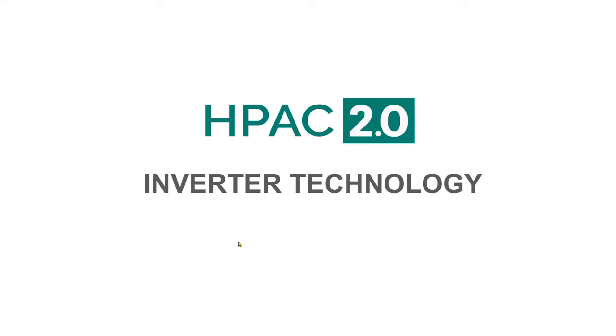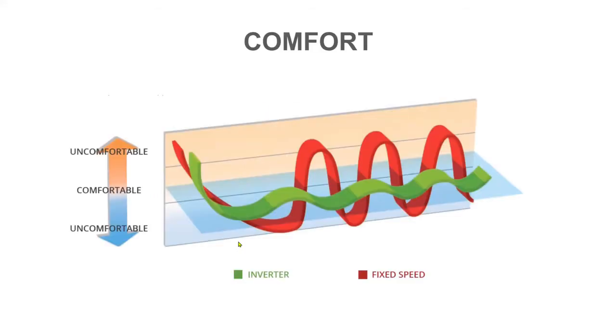What an inverter does is, you basically have a compressor, and there are two kinds of compressor. You have a fixed speed compressor, which can only do whatever speed it's set for, 9,000 BTUs, and it can either do 9,000 BTUs or zero. When you have an inverter compressor, it's a flexible linear compressor. What that means is that, let's say it's designed for 9,000 BTU, but it can go as low as 1,000 BTUs and as high as 11,000 BTUs. The benefit of that is multiple, and I'll go through each of those benefits.